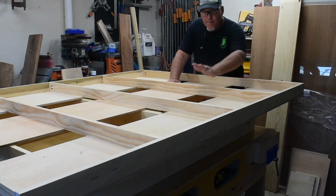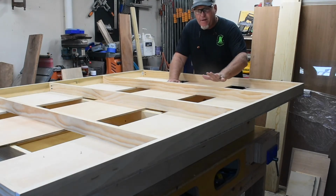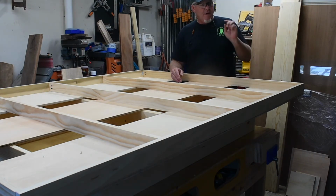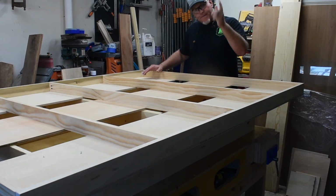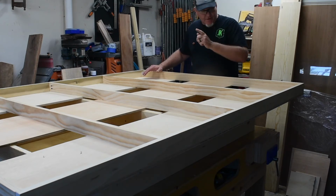here. And I've also got the bed board here done. So now what I'm going to do is I'm going to take my plywood, I'm going to stack them together in the stack of three. I'm going to cut all three of them at the same time because my saw will cut them all at the same time, so I get them right at 82 inches because that's how long it is from that end to this end. And then we'll go to put in the sides on. Anyways, let's get started.